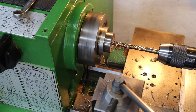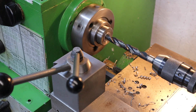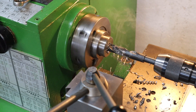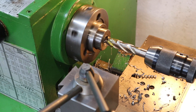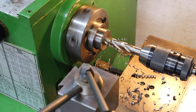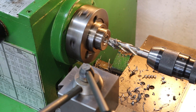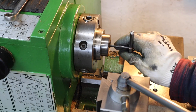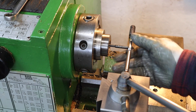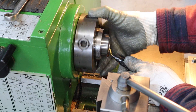Once I've got that, I work on the shallow 18mm hole which is going to be the bed for the inserts. Going up in stages in drill sizes I get this fairly close to final dimensions before coming in with an 18mm roughing end mill. It's not going to give the best internal surface finish, but it will give the flat bottom I need for the inserts to sit flush. With those holes done I go back in and tap the final hole to accept an M6 bolt, then break the sharp edges with a deburring tool.